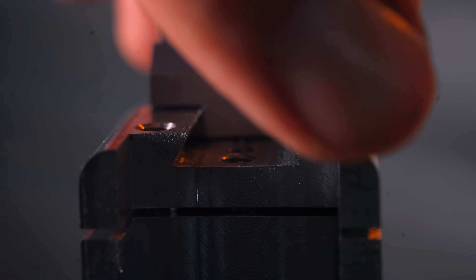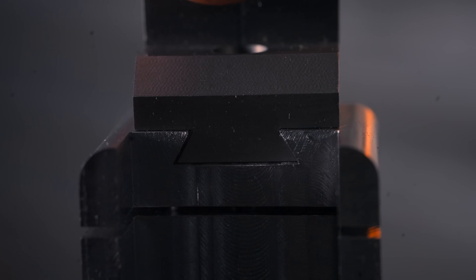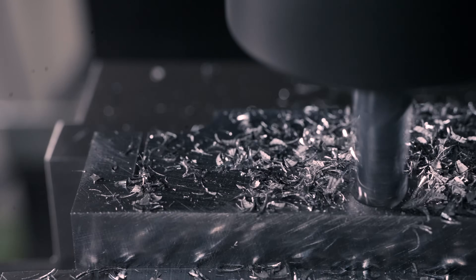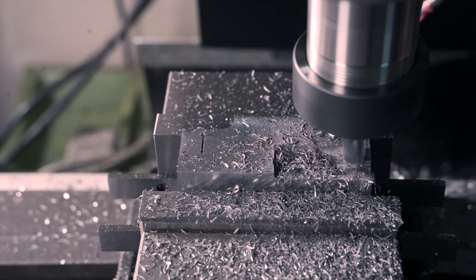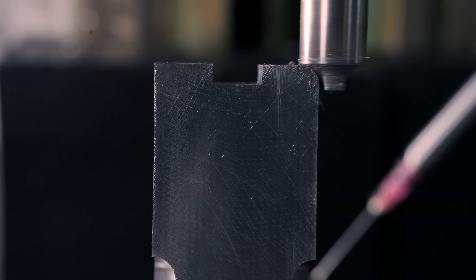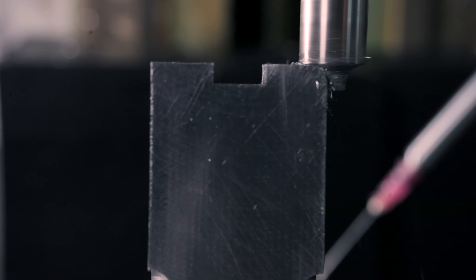Sadly, I am not a good fit — because despite having a perfect master, I managed to overshoot the dovetail anyway. But it's okay because it wasn't critical for the functionality, just for my pride. To finish this piece, I used a ball end mill to cut a side pocket on both sides, to make it nicer to handle and a bit sexier than a plain square block of steel. After that, a round corner for aesthetics, and it's done.